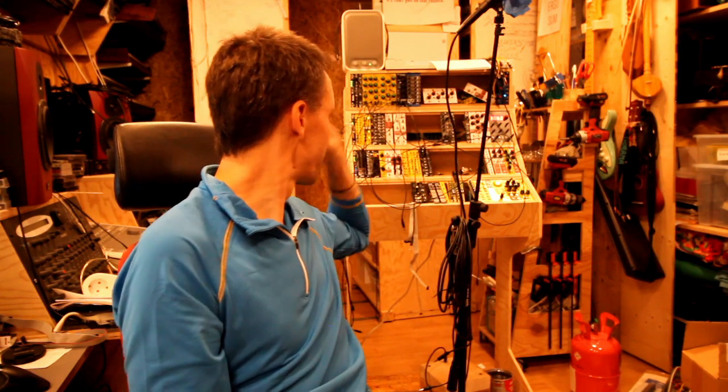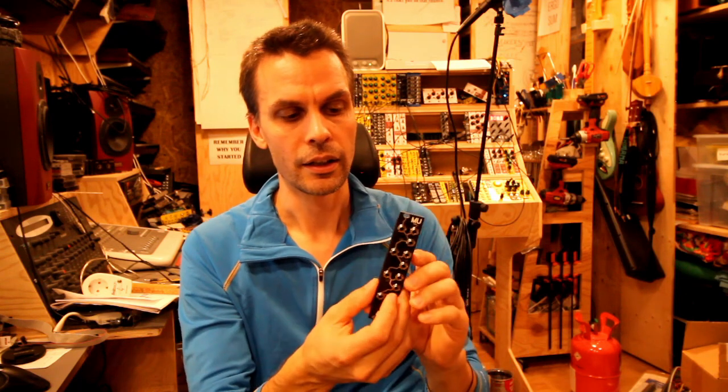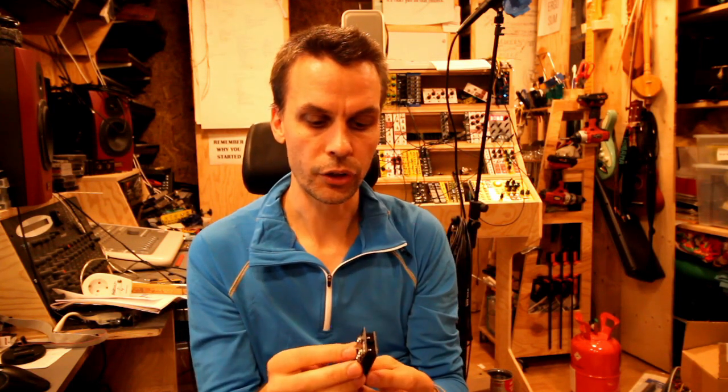At the same time I'm releasing the shortest build video I've made, which is for the Multiple — I've done it before, but this time with Thonkycon jacks, which you can buy it with. Thonkycon jacks make it even easier and add much more quality to the module, along with hex nuts. If you want to build it with Thonkycons it's super simple — I really shouldn't need to make a build video — but there's one small thing with the ground legs: two ground legs share one solder pad, which might trip someone up, so I just want to clarify that.